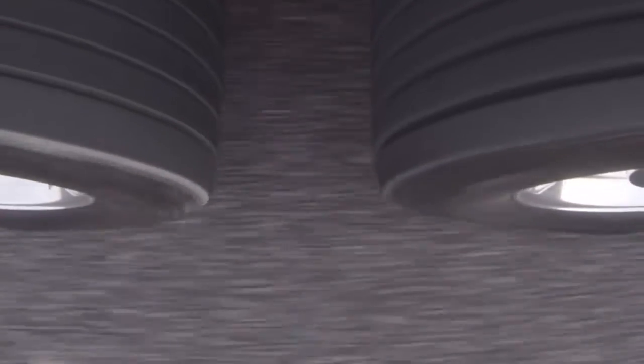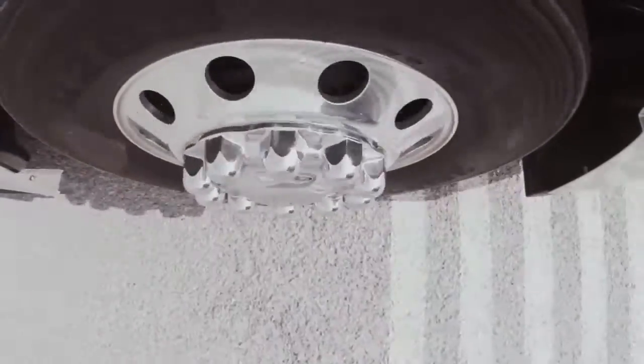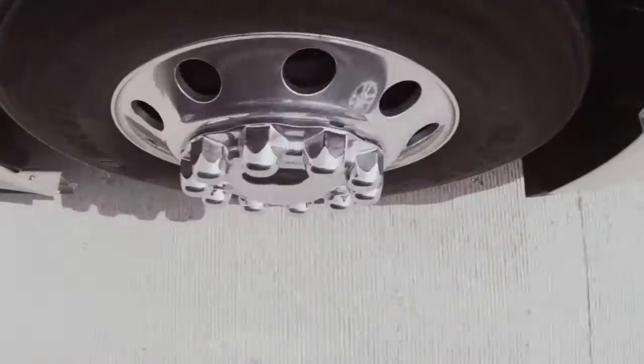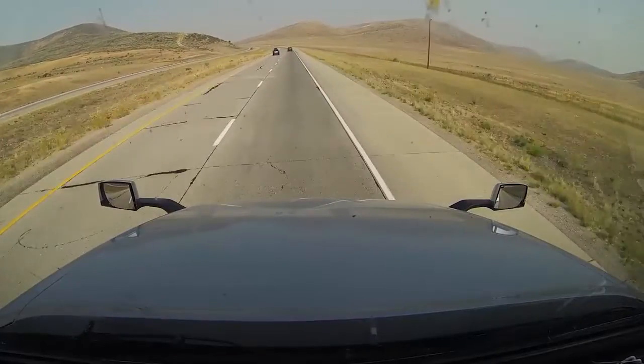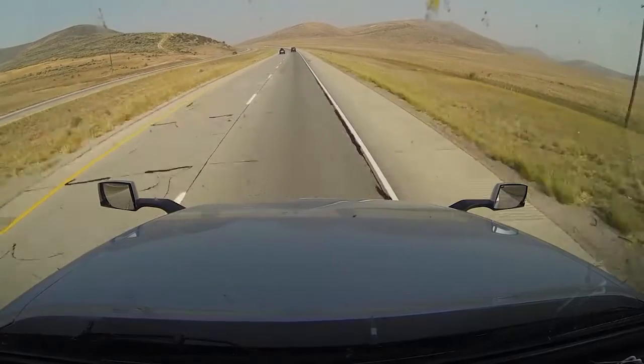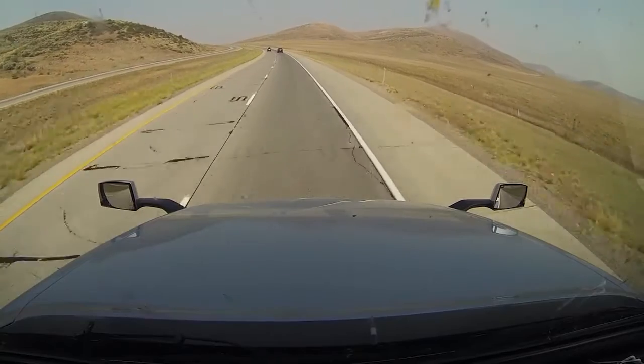There are a number of ways this system will save you fuel as well. You've only got one drive axle, so what we're missing on the front axle is all that gearing — crown and pinion gears, the drive shafts, all that stuff that goes around and around. That's all just pure parasitic drag. So if you don't need it, dispense with it, and you eliminate some of the drag on the driveline which saves fuel. You're also toting less weight around because you don't have that big axle carrier, the big differential housing and all the gears inside — there's about a 300-pound savings there.